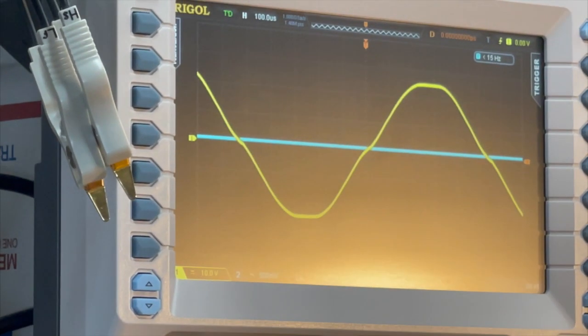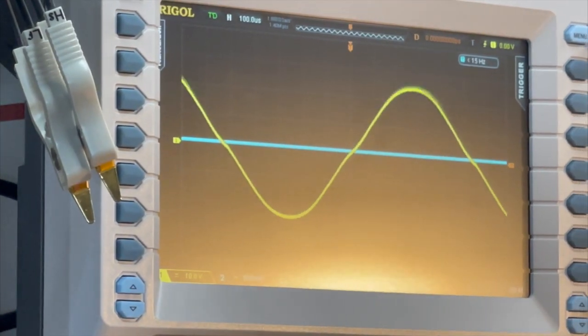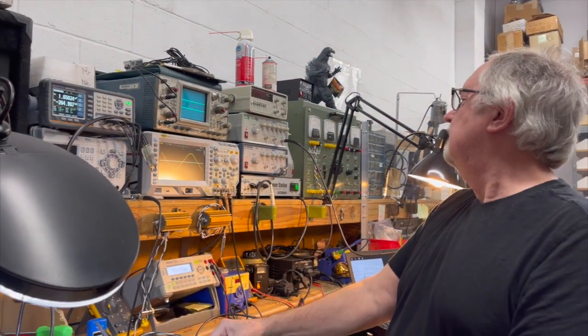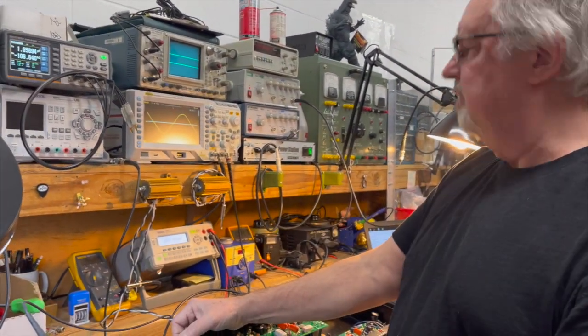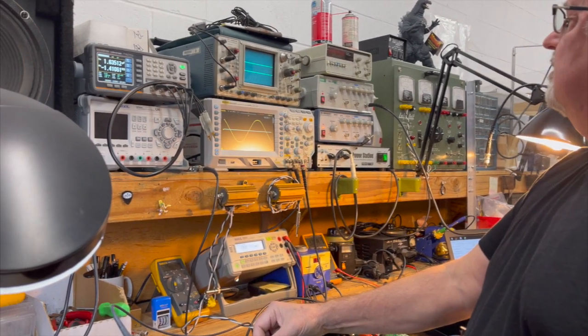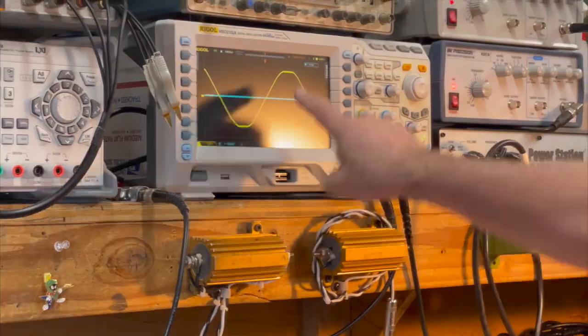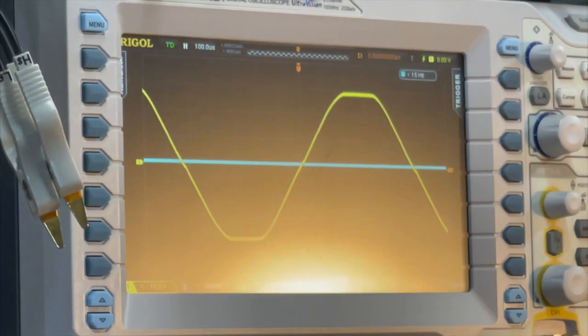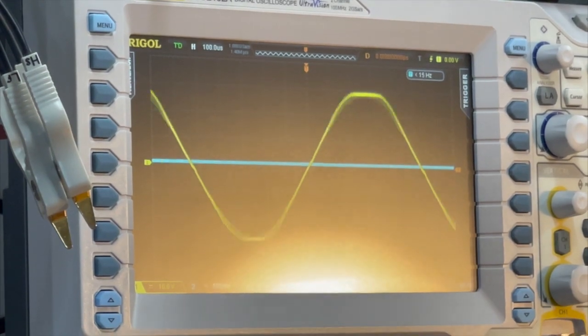Well, and it's then a visual representation of how it feels. Right. It's going to be spongier. It's going to have a little bit more fizz. It's going to sound more saturated. Yeah. It's going to have that gushy feel that a lot of people love. Yeah. And then we're going to go back to the solid-state rectifier, and we're way up there, no crossover distortion. The bias on this one is basically set perfectly, and I'm not going to mess with it.